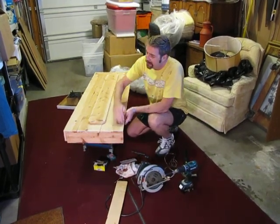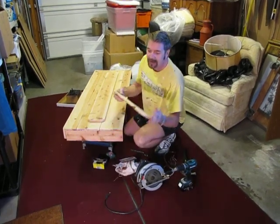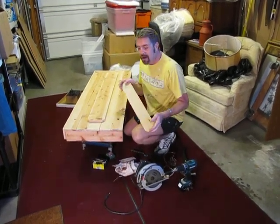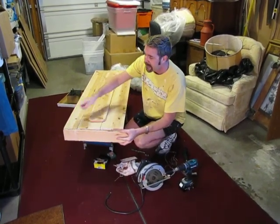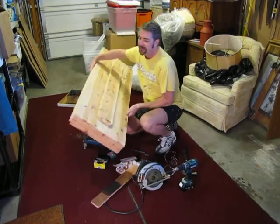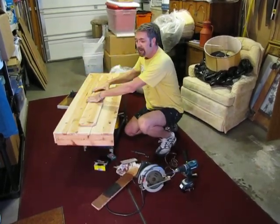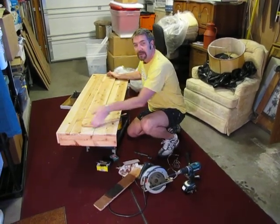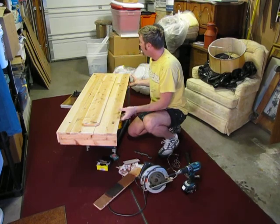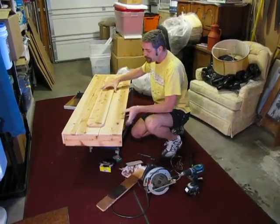Then after trimming all these back, I cut another piece of our excess wood to save on cost, and we attached it to the side, nailed it to the top, and then did another board up here the same way. For a little bit of a decoration, I went and got a 1x6, and I trimmed that down, leaving the clipped corner from the fence, and then also clipped it on the opposite side just to kind of give it some dimension.